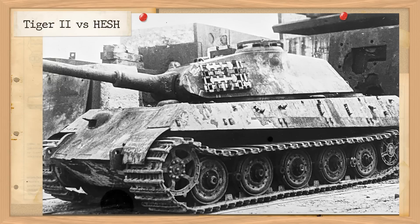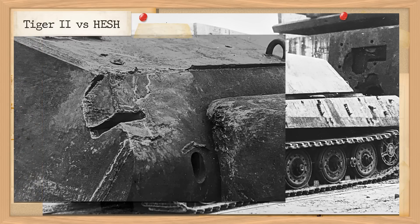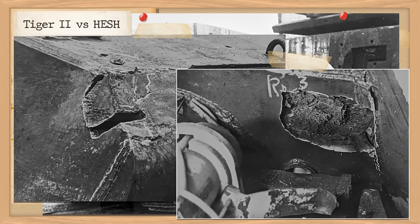Next up was the turret. Shot 3 was aimed at the turret's left side cheek but went slightly higher than planned. The round left a 12 by 9 inch dent, broke the joint separating the parts, cracked the welds down to the turret ring, and left two distinct cracks in the turret top — though both hatches remained operational. Inside, an 8 by 7.5 inch scab was found six feet away, and the witness plates were peppered with light spall. The scab destroyed the machine gun, the tank's breech, and the turret race bolts. Inspection of the straw dummies showed all crew would have been killed: the loader had holes through its stomach, head, and legs; the gunner had two holes in the head; and the commander had punctures through the head and shoulder. This would have been a total kill.